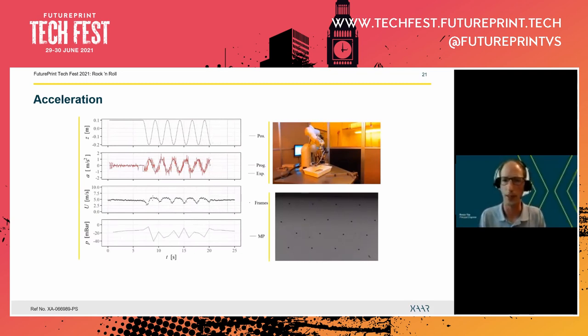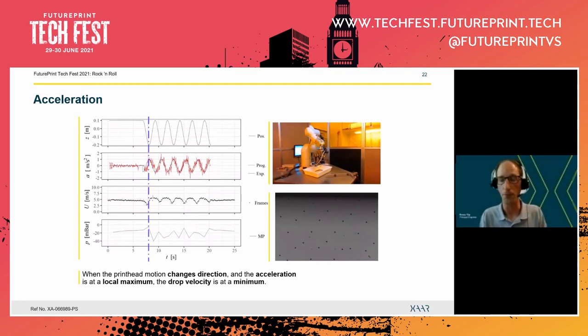So what's going on here? Well, let me just pick two very specific points, starting with the point where the printhead is in the most downward position. So this is the first time it has moved from the top to the bottom. And this is actually the point where the printhead is now starting just to go up again. So what we get actually is that the ink, due to inertia, still wants to go further down. So actually we have here a little bit larger pressure, very similar to what we saw for a change of orientation. A larger nozzle pressure leads to more ink in the nozzle, and that's why we see that there's actually a lower velocity. And that's exactly what we see in the graph here on the left as well.